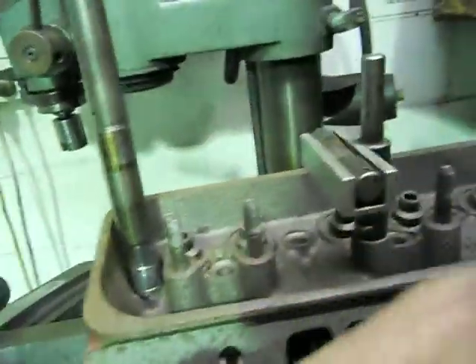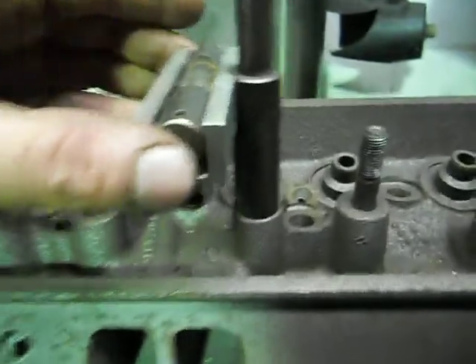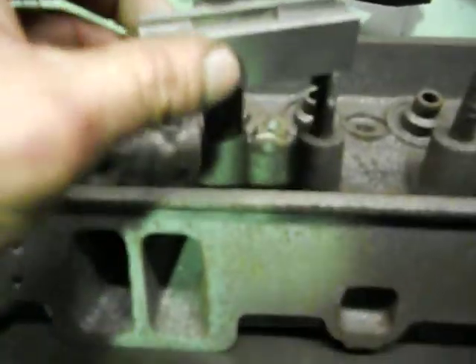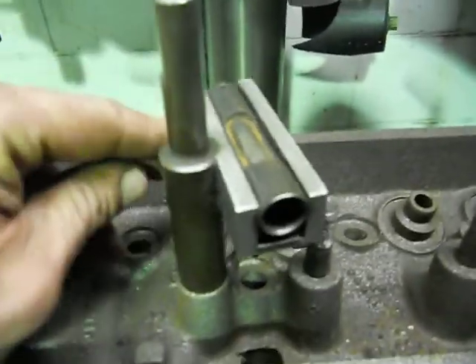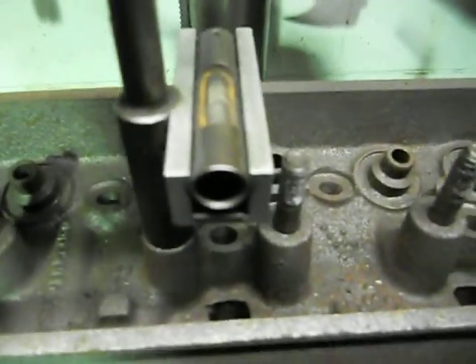To go longitudinally, the bed can actually slide up on these two adjustments, so it'll slide up like that to get your correction that way. All we do is sit up here and just knock it back and forth. Always check it both ways — that way you can take out any error in the machine level being out. Check both ways that way.